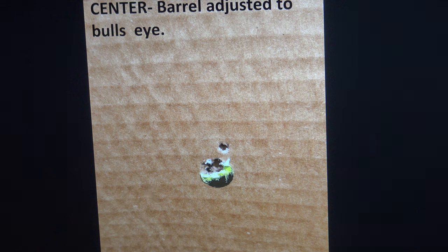If you have shrouds and baffles like we do and you bend the barrel to shift the point of impact, be aware the baffles may start clipping the pellet. The only fix is to make the baffle holes bigger — they won't be as quiet, but you have to give and take. Also, if your gun is throwing shots all over — one here, one there, one down there — that's telling you there's a problem you need to find and fix.